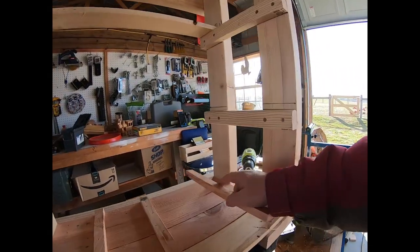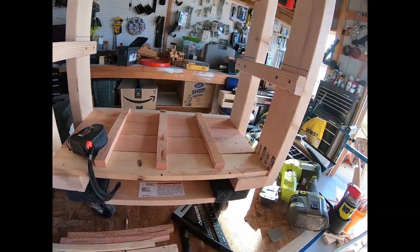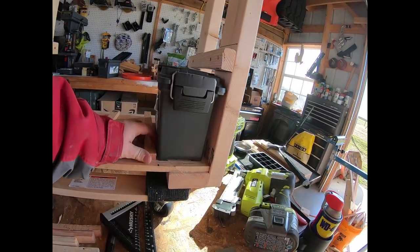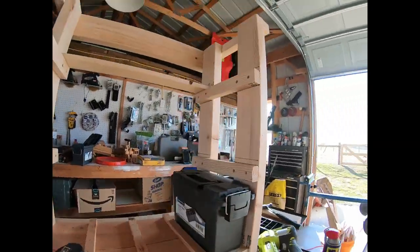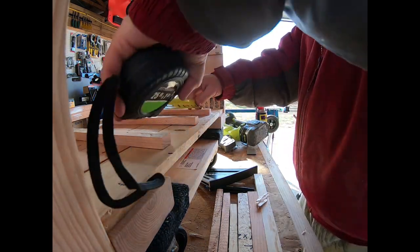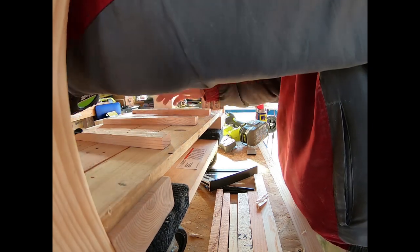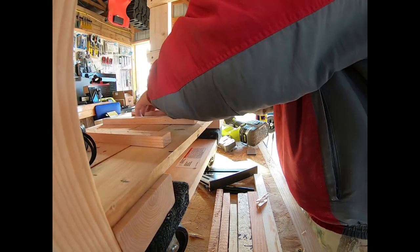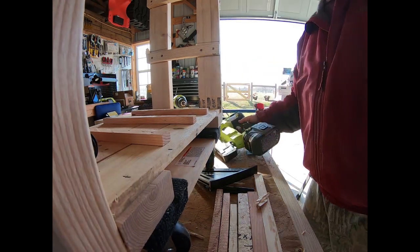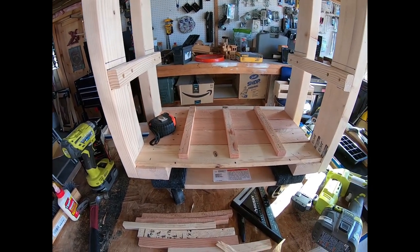Okay, put my last strip in here. Double check a box, make sure it fits. There we go, 1/4 inch from that mark. Measure 4 1/4. I'm gonna go ahead and put my other two shelves on, the strips. And I'll come back with you after that is done.